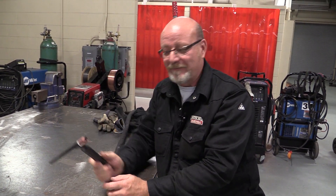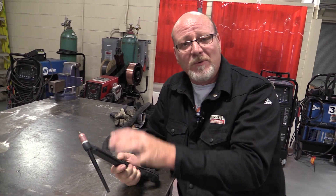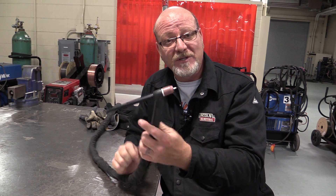Today we're talking about TIG welding. There are a couple things with TIG welders you need to know. One is the consumables on the end of them, but we also have a lot of Dynasty 200 Miller TIG welders. They have a separate water cooler, and when you use them you have to plug the water cooler into the outlet on your booth. If you don't, you can overheat them and burn these torches up.